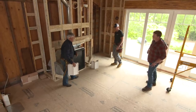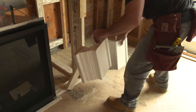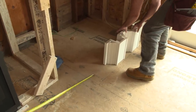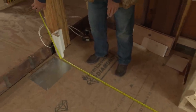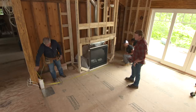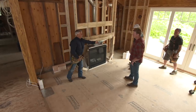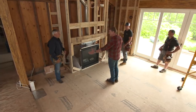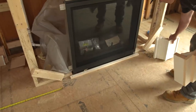Now we have to divide this space up into three equal spaces. The easiest way to do that is take these pieces, put them up against the face of that, and measure from the face of those pieces on this side. So this is the total of your negative space — it's 12 foot, a little over a quarter of an inch. We divide that by three: we have 48 and a sixteenth, 48 and a sixteenth, 48 and a sixteenth. Perfectly divided right down here. So that's where we end up with our new beams — everything else is the negative space. Now we'll place those in position.